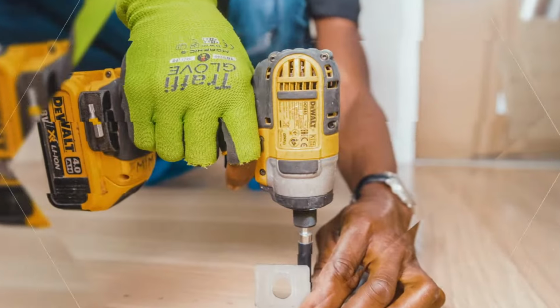So the way it works is, you drill your hole first in your concrete, and then you drop your anchor in. And if you notice on the tip of the anchor here, you see a space that's not threaded. That's where you can use a hammer to hit the anchor further down into the hole. Then once it gets to the depth that you want, you can start to screw this nut clockwise, tightening it down. And as you tighten it, this part of the anchor starts to spread, which anchors itself into the concrete. Same thing happens with the sleeve anchor when you're anchoring it into brick or block or masonry. You hit it with a hammer on top and you tighten the nut. And as you tighten it, this whole sleeve expands and it anchors itself into the masonry of block or brick.